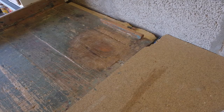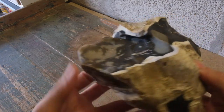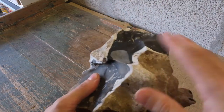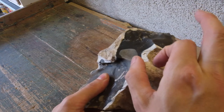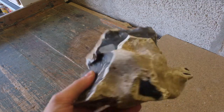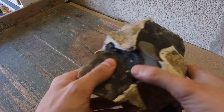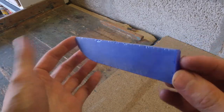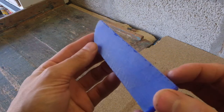The only thing that you're really missing here is the actual slabbing. Now, when we have a rock like this, gorgeous piece of Wiltshire flint, you would slab it. You would go this way, and you would have loads of gorgeous, just the right thickness slabs that you could draw on with a Sharpie, a knife shape, and then cut it out with a diamond saw. And then you'll end up with something like this. Already cut out, the perfect thickness.